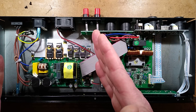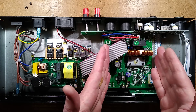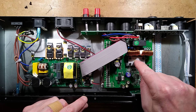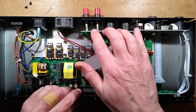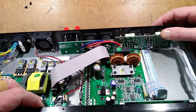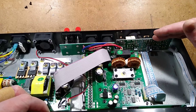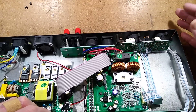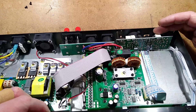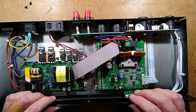The basic thing is we've got the power supply board, a ribbon cable taking power across, and we've got the amplifier board with a very interesting way of clamping the transistors down. We've got the speaker board, and then a little board which is the incoming signal — covered in low-noise op-amps that deal with the balanced signals and process it for feeding over to the amplifier.